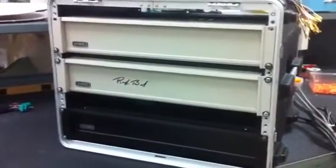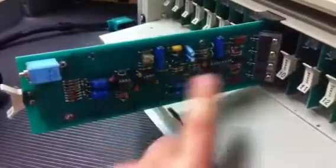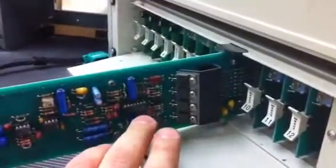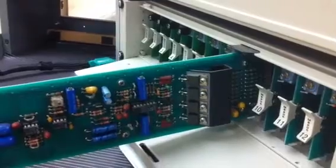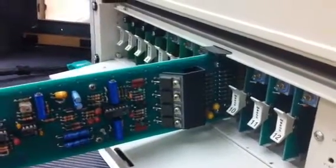This D-to-A converter has OPA275s and it has three discrete stereo outputs — three copies of the same stereo signal via those OPA275s. Those feed the top two distribution racks. These distribution racks are 8205 Unity buffer with gain: plus 4 in, plus 4 out. It's gain because you are driving these load resistors.